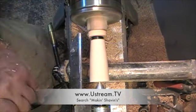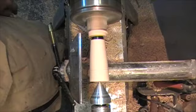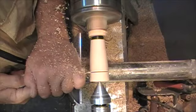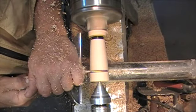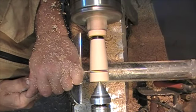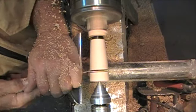Just for reference, I'm looking for a 2.5 inch piece, right? It gives me a good 1/4 inch in the bottom. I marked that, and I'm going to cut it. But I'm going to cut early, which means back here. Why? Because if it tore or jumped a little bit, I can sneak up on it. I want that cut to be real clean.